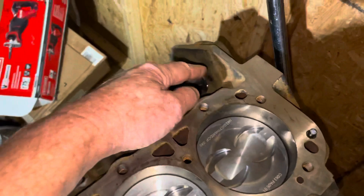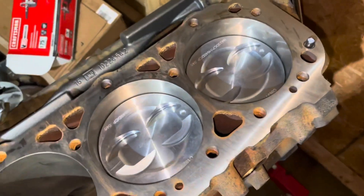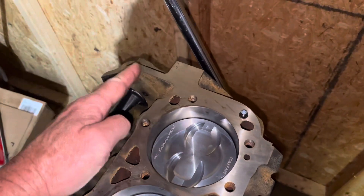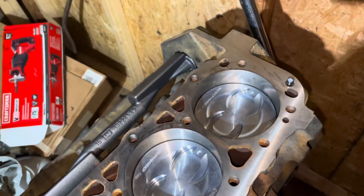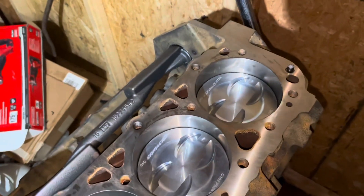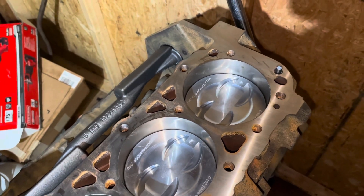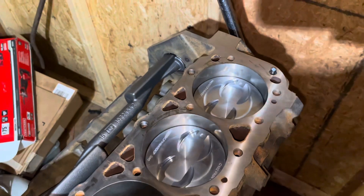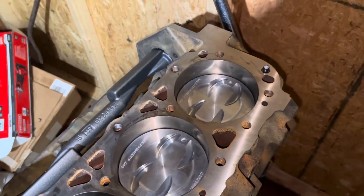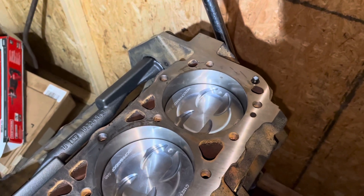There was a port at the front of the intake that would leak coolant down into the engine and mix with oil. The problem was at the junction where the intake met the cylinder head — it wasn't a blown head gasket, it was that joint. My son had a 2002 GMC Sierra with the 4.3 at about 120,000 miles that started misfiring while coasting downhill or on a flat highway. Under heavier load it ran fine. What I figured out was that under light load you have high vacuum, which was sucking coolant into the engine and causing the misfire.